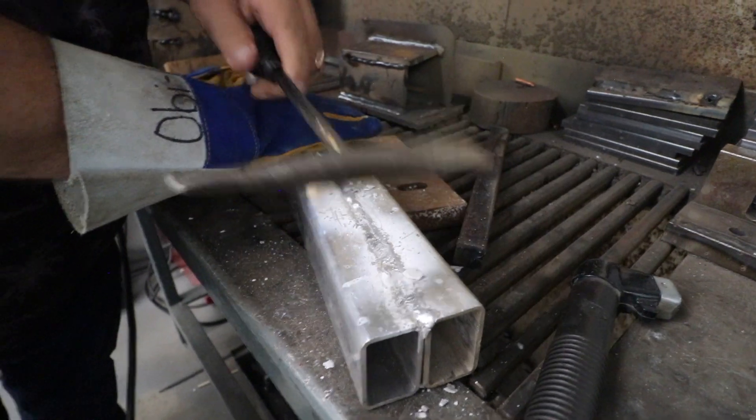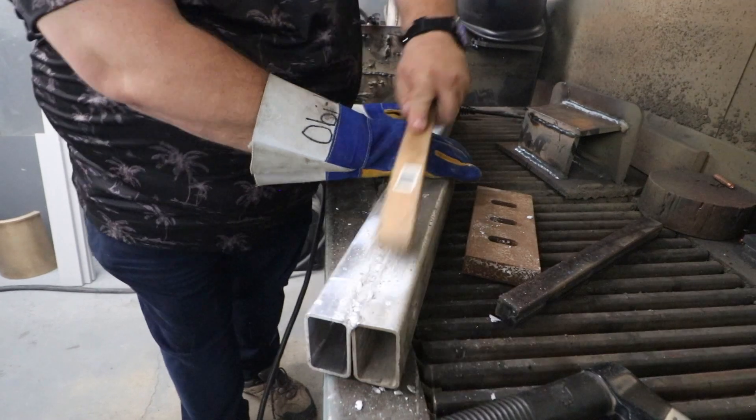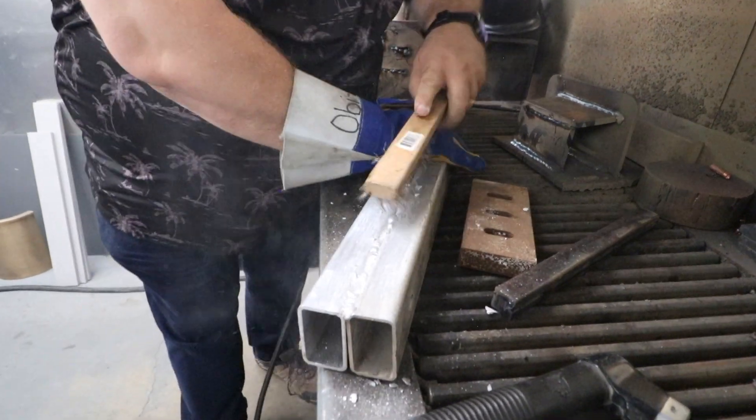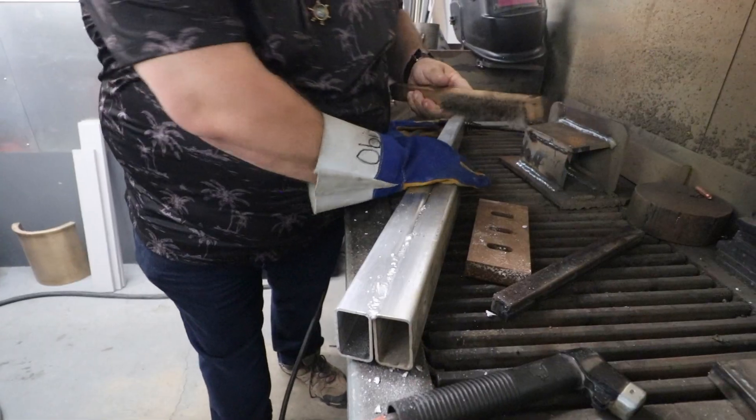You can see there, when you preheat aluminum, it will actually do a very nice job — very effective on a joint. Maybe you want to run a few inches of that, and that's a good joint.